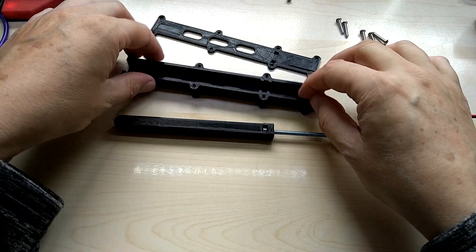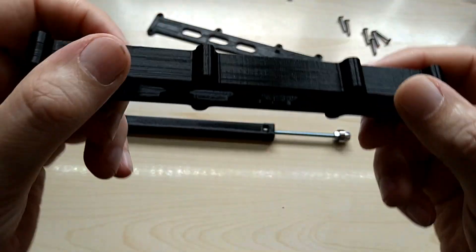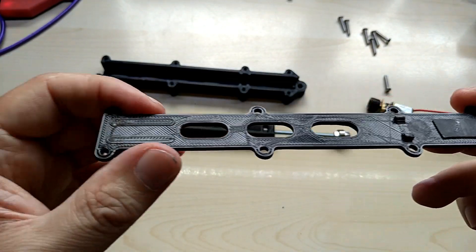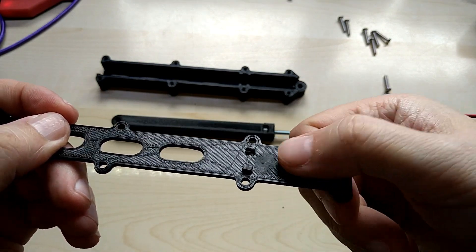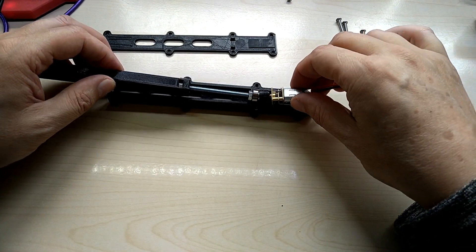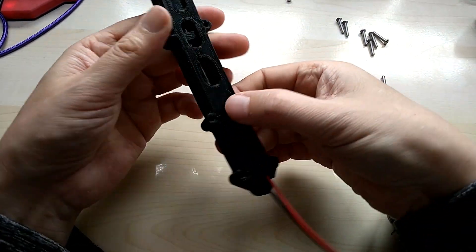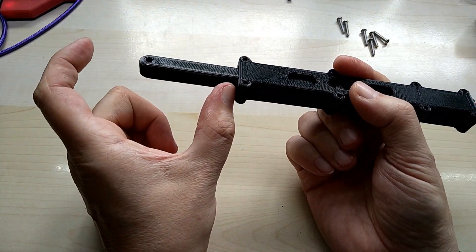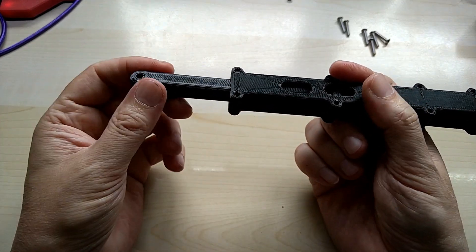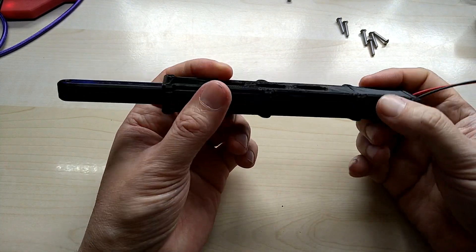Technically there are four parts. This is the bottom part, and I used PLA to print this. This is the lid — I had to file it down a little bit to make the motor fit. Putting it together is simple: put the lid back on and screw it together. This design has a travel of 98 millimeters — depending on the settings you might get a full 100 millimeters out of it, which is roughly 4 inches.